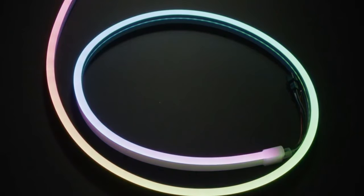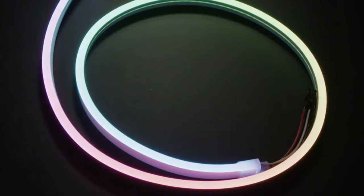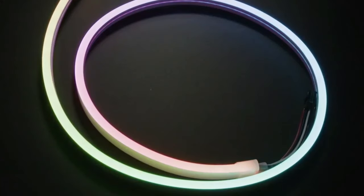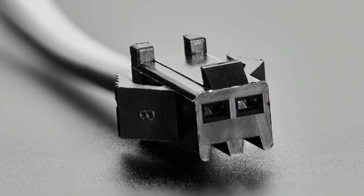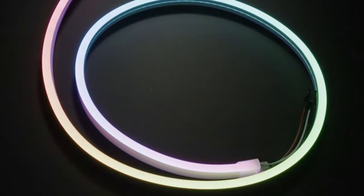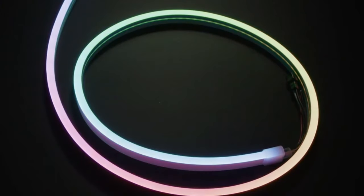As you see in the animation, it has full RGB control per pixel, and then either cool white or warm white — you'll see a nice beautiful warm white LED as well. So you can get extremely colorful color changes or white pixels. Don't forget to set your mode to RGBW on your controller, but it's otherwise NeoPixel compatible and five-volt friendly.